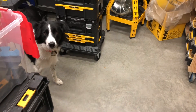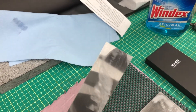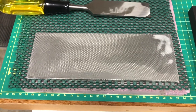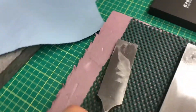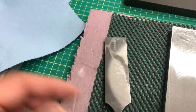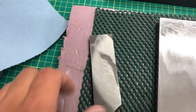Rex told me I need to get even better with my chisels, so he said I should have a better look at some of my other ones. This is the Lee Valley set I have, and I was working with the 1200 grit but it was taking forever. So I went out and got the 600 grit - good for flattening other stones and getting things going faster. I find that almost every single one of these Lee Valley chisels has the exact same grind pattern on it, whether I use sandpaper, diamond plates, or old wet stones.